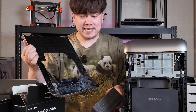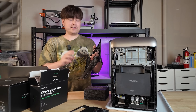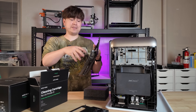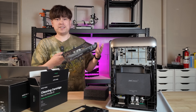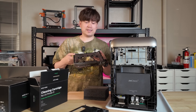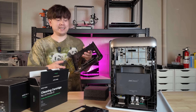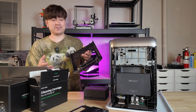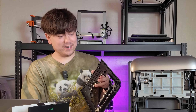The resin had actually melted some of the foam packing material used to protect the printer, and that melted cocktail seeped into the machine and kind of glued everything together. To clean it out, I used acetone-soaked rags and wiped everything up as much as I could. Then I set everything out in the sun to cure — it's UV cure resin, so setting it out in the sun helps dry things up. The solvent needed to evaporate and everything needed to cure, and after about a week of letting it sit out, it was pretty much not so bad.